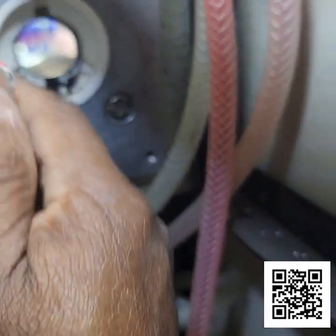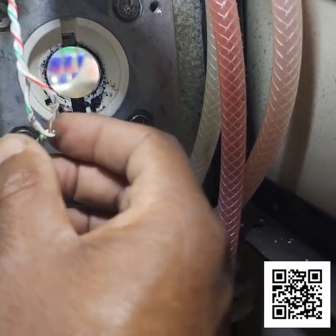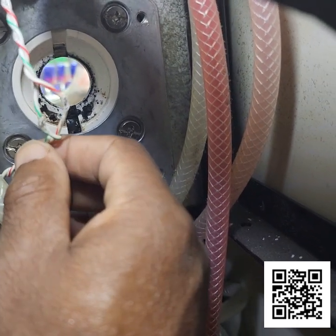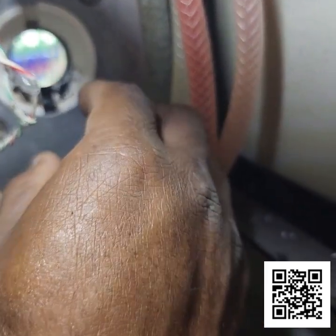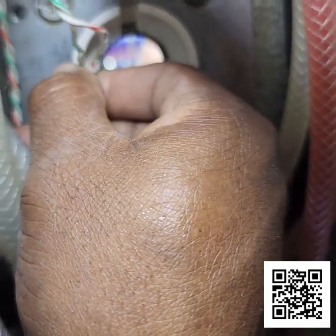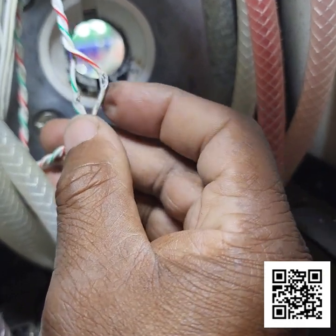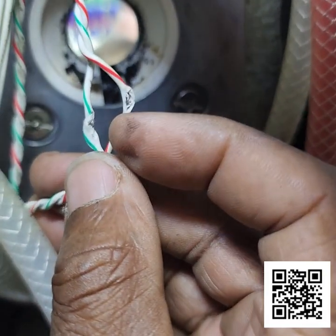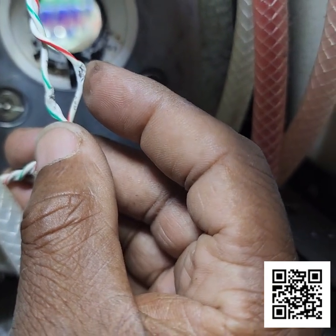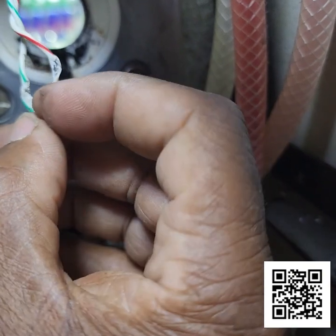the motor mounts right up against here, and it seems that when they replaced this motor a few days ago, they got the motor in, and then the wire got smashed in between the motor and the bracket here. So as you can see, it's cut. The insulation got cut, and the motor was touching against the metal on both sides pretty much.